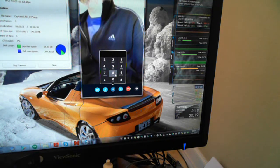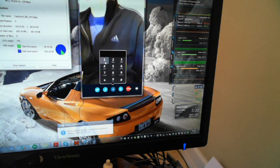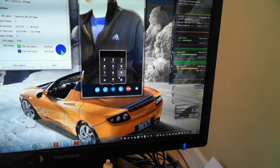So to change the speed, the pulse width modulation, there are 4 buttons. So it's the outside corners. The ones down here control the incremental, small increment speed. So this is increment up. Small increments, this is an increment down, small increments. And then the 1 and the 3 are the down large increments and up large increments. And this can all be done dynamically while you're moving.